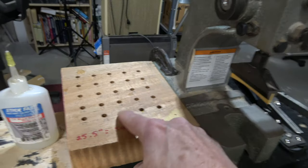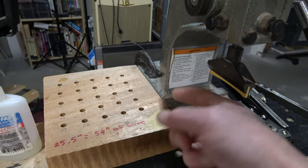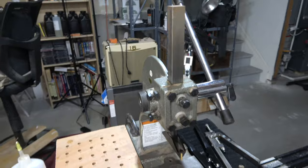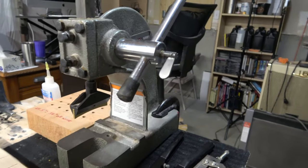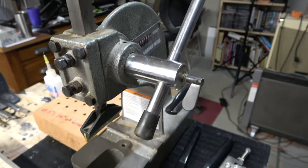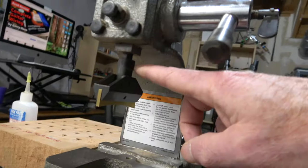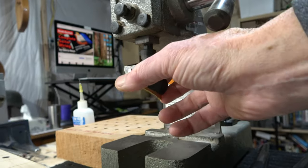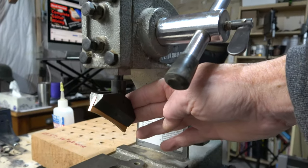Then I've got this block of mahogany that has holes drilled in it — they're numbered so I can keep all my frets organized from the first fret all the way down to 20 or 21 frets. And then this is my half-ton arbor press, which is what I use to press the frets into the neck. I purchased this many years ago from Harbor Freight — I don't think they sell a half-ton anymore, just a one-ton, but you can buy half-ton arbor presses all over the internet and they're not that expensive. All I did was drill a hole to accommodate a fret press caul, and I've got inserts for all the different radius fretboards — in this case, a seven and a quarter inch radius insert.